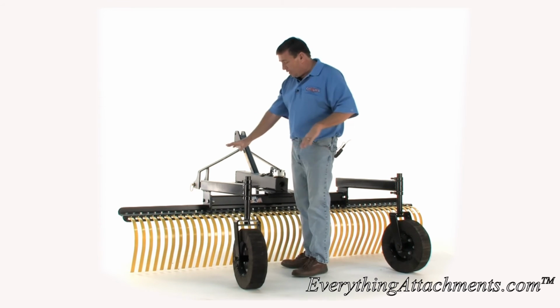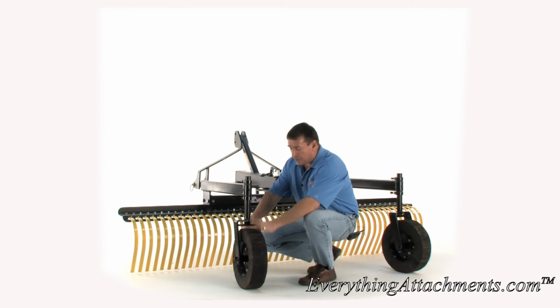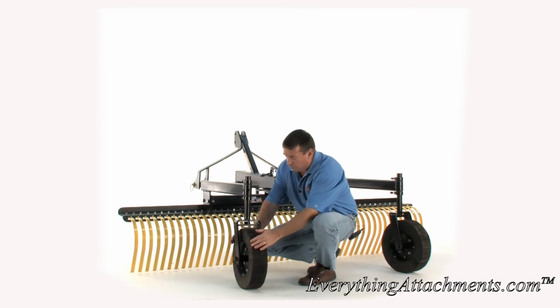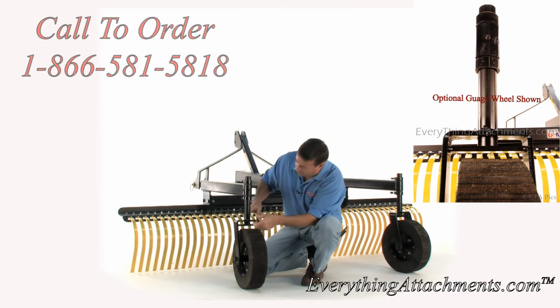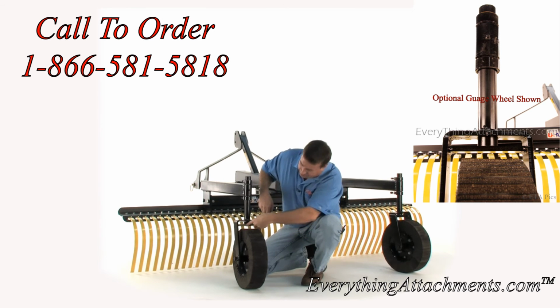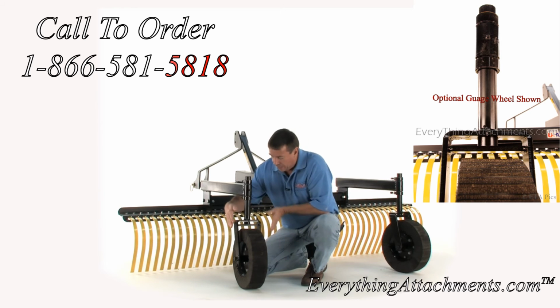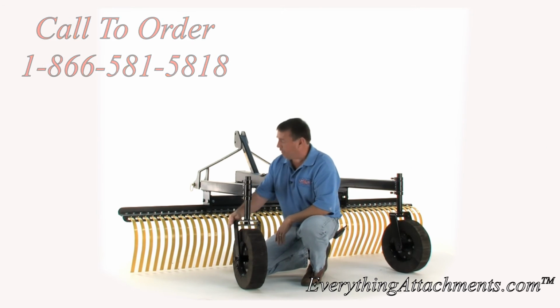So then we'll go to the tail wheels here. This particular tail wheel is a laminated tail wheel similar to what would be on a bush hog. Now we've done some extra things to make this better. This particular shaft goes all the way down to a second piece, making this yoke stronger. And this is all cut out of one machine.